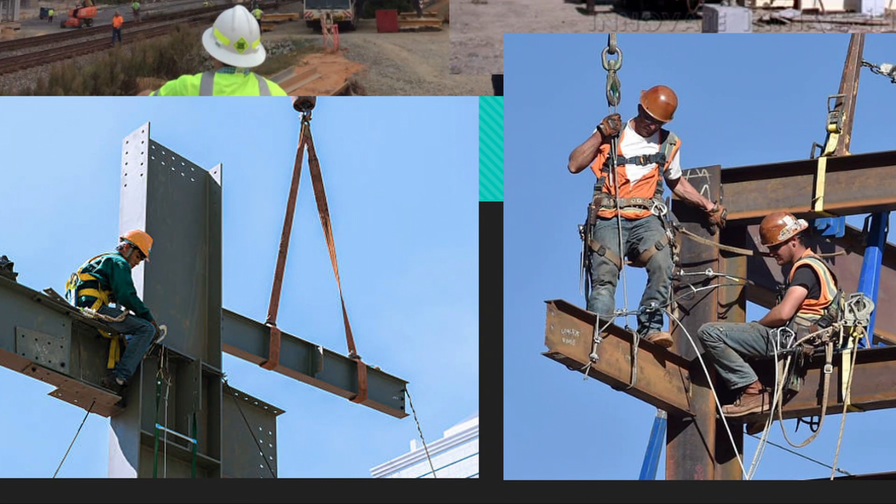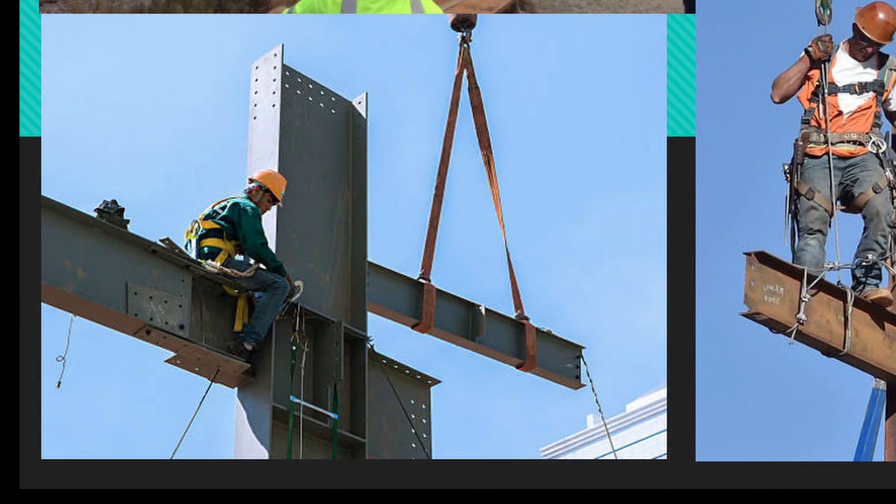Field correction of fabricated steel by gas cutting is not permitted without prior approval of the client. Here are some pictures of structural steel erections. The riggers are equipped with safety harnesses and working with full safety. Man-lifts shall be used to fix horizontal beams on pipe racks under 24 meters. For those above 24 meters, scaffolding is recommended.